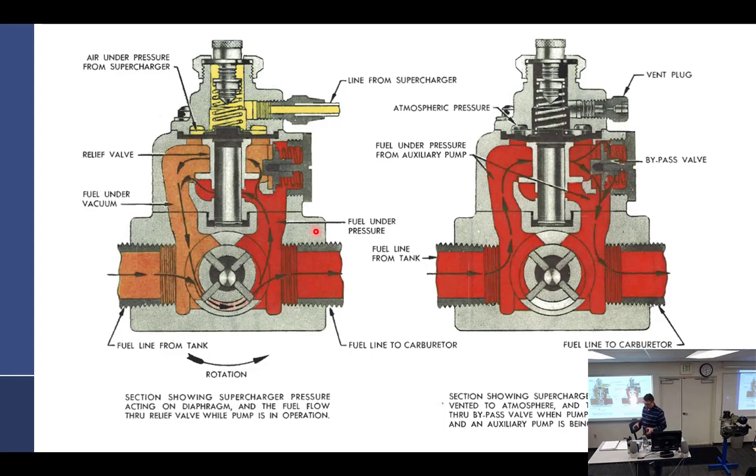If I said it's a right-hand rotating pump, rotation is when viewed from the drive end of the pump. The direction of rotation is when viewed from the drive end of the pump, and this dictates which side is the discharge.